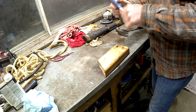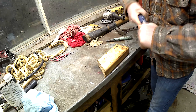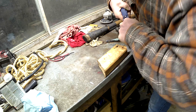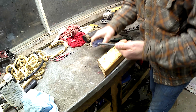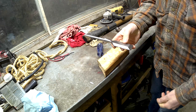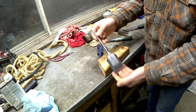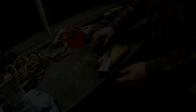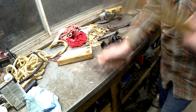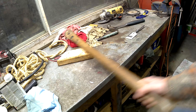Anyway I digress. Here I am pounding on the handle to take it apart. Yay, success! You can see it's got a nice strong tang that's quite long — it should support it well in the new handle. It has some nice grooves and knobs on the tang itself that will help grab the epoxy that's going to hold it into the new handle.